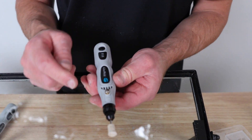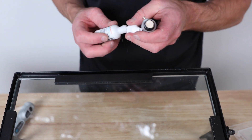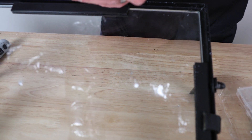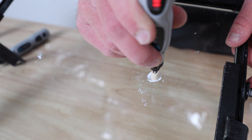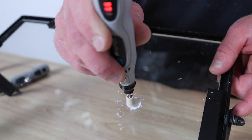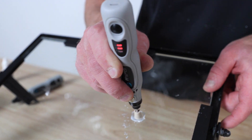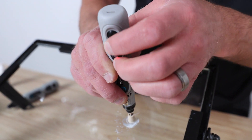Now let's show you how it can be used for polishing a pit. This one is set up with the 3/32nd collet and the polishing cork already built in. We've got a pit right here — put a little bit of pit polish right over that impact point that's already been scraped, turn it on up to maybe medium, and go right over the surface. Keep it very flat and you don't really need to move it around much — just make sure you're covering the pit itself.